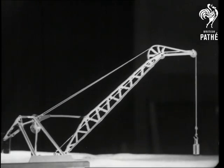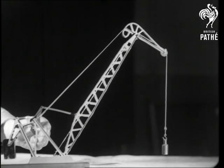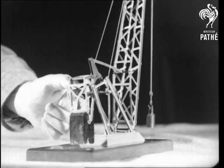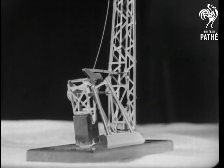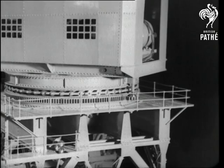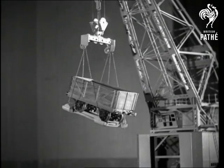The balanced lever type of 1928, with a jib made in two parts, so that the load, when the main arm is pulled inwards, remains at the same height all the time. A model of the ingenious crane at Grangemouth for loading coal direct from the truck to the collier. A ten ton truck runs onto a cradle, hooks catch against the front axle, and the load is lowered and tipped into the hold.